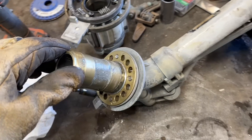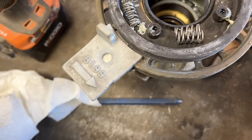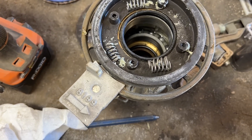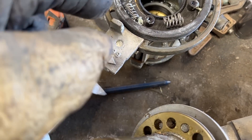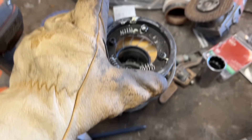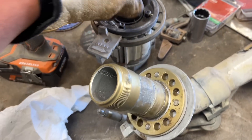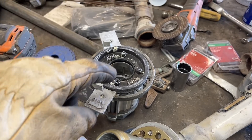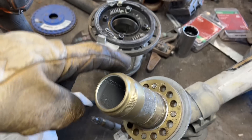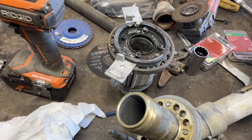I've got it all here now. If I clean this up, it looks like it just threads in down in there. There are bearings that sit right here and here, and there are bearings down there — and right here is another bearing. The problem is there's water in the bearings, and normally this is all sealed, so that's not good. These little springs sit in these holes and then they put pressure on this plate right here — that's what spins. I lost one of the springs. This piece fell off and then it just had water coming out, so I don't know if there was a spring in every one of these holes or just four springs, because it could have washed them off.